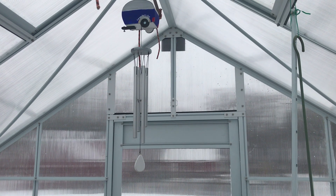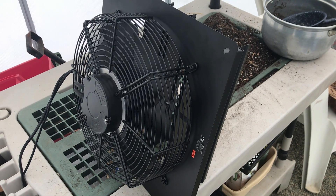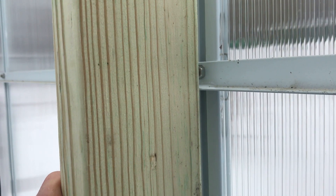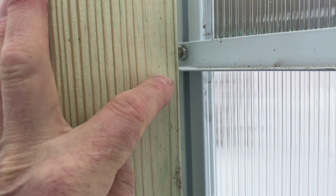My plan is to put an input vent down over the door on this end of the greenhouse and put a ventilation fan blowing out at the other end. I purchased this louvered fan to put inside the greenhouse but it's a lot heavier than I originally expected. I was going to install it up in the top of this end of the greenhouse but I'm going to have to build up a 2x4 frame to hold the weight. I want to lean the 2x4 against the wall but this L-brace is in the way, so I'm going to have to notch out a little bit on the 2x4.